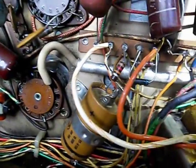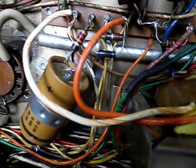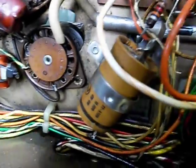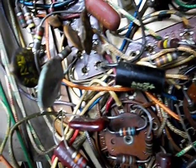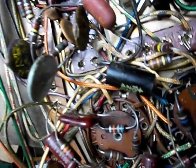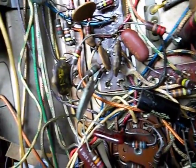The other thing I did — for no real good reason at all — but since I had an issue with the transformer developing that short, I double-checked any capacitors in the primary circuit as well. The only thing over there was this little dual-disc cap right here. One side of it connects up to the primary — well, it goes through a resistor. There's no way that cap could be bad or cause something to go wrong, but I checked it anyway. It was fine.